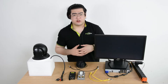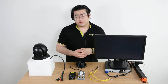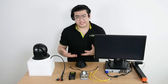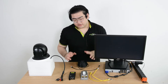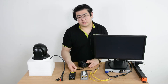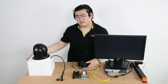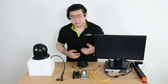For an IP device far away, in our previous video we talked about using PoE extenders — the one-input, two-output model — to create a 500-meter daisy chain extension. In this video, what we're going to do is connect the PoE-NVR to the PoE injector, then the PoE injector will connect to the extender, and the PoE extender then connects to the PoE IP camera. That is the basic procedure.